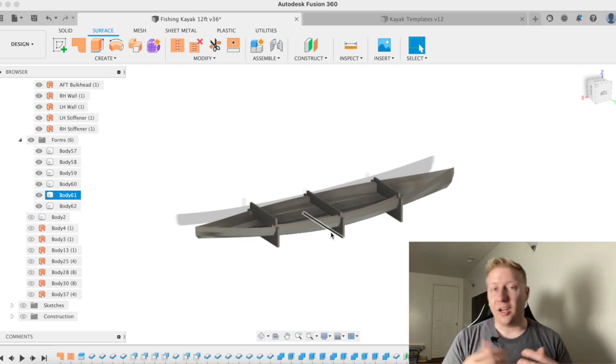However, in the other directions, there's really not that much stress on the structure. To use more carbon fiber there wouldn't really be necessary. We could almost certainly build a lighter structure if I used a very, very lightweight carbon fiber cloth to handle those stresses in the other directions. However, very lightweight carbon fiber cloth is obscenely expensive. It would add hundreds of dollars to this build. I'm not exaggerating at all. So instead, what I'm going to use is a lighter weight fiberglass, which is just a few dollars a yard, and it's going to handle the stresses in those directions.